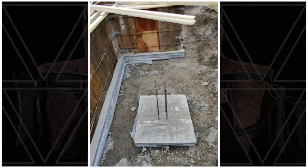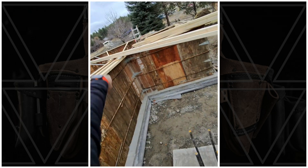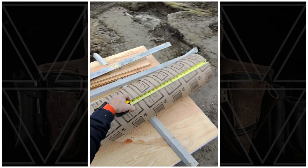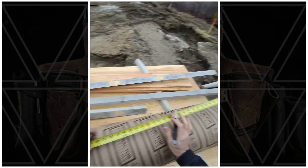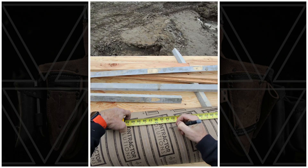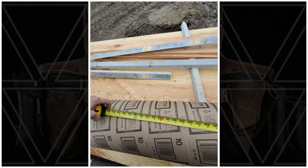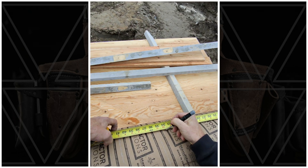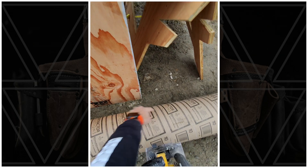We've got a front entry patio that's going to be right up here, so I'm going to bring a sonotube up to the underside of our front entry slab. The sonotube is just going to be 34 inches long — just a little guy. I'll make a few marks around here, and when I make this cut I'm going to focus on keeping the shoe of the saw square to the tube, eyeballing across the shoe and the tube and following my marks.